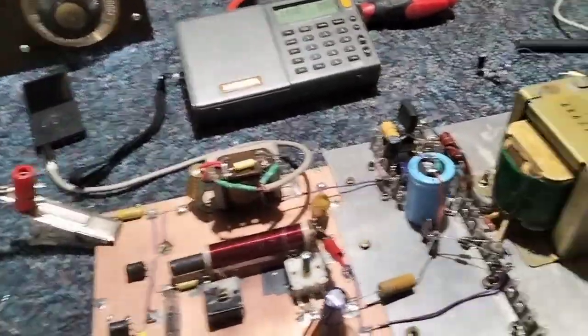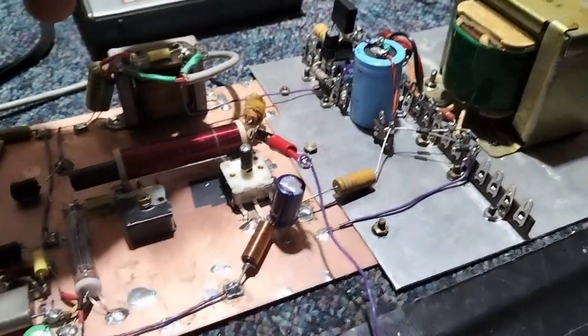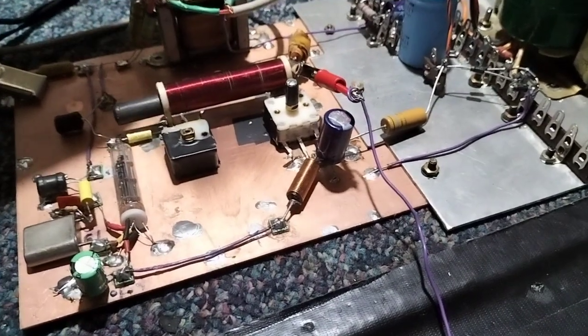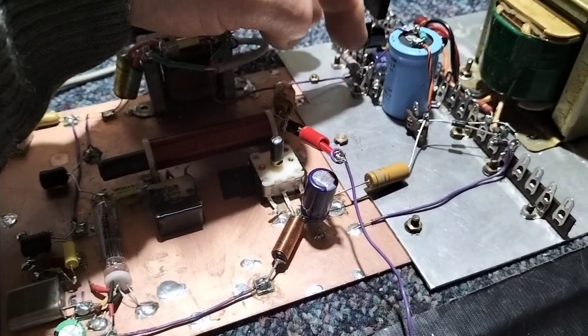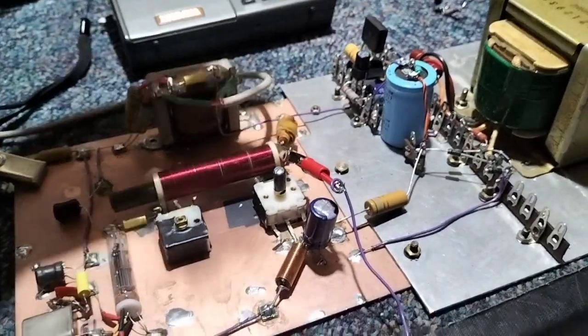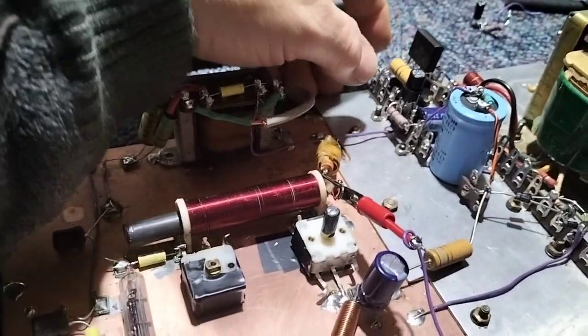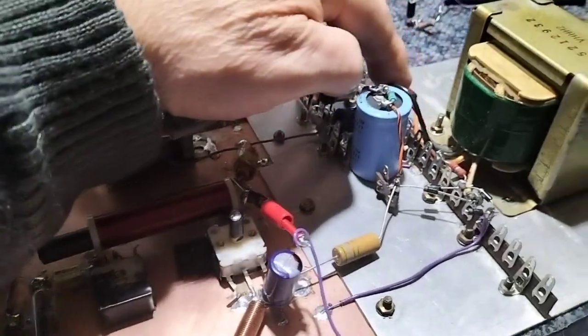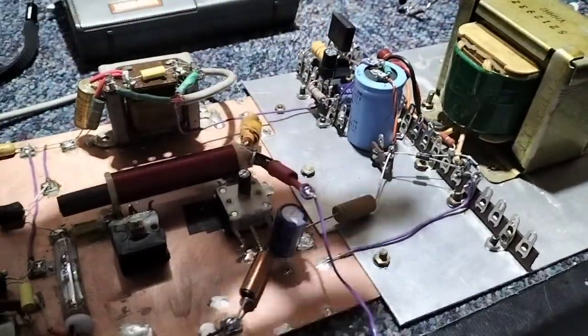These little things are easy to do. The power supply looks a bit more complicated, but all it is is a bridge rectifier for HT and a Schottky bridge for LT. Pretty high smoothing to keep it clean — it's a filamentary valve, so we need to make sure the filaments have no AC ripple. The HT is well smoothed: first smoothing is 100 µF, second is 330 µF. There's a little Wickman fuse just in case something pops. The smoothing resistor is 470 ohms — we're not using a choke. This little 150 is actually between two tappings in series to give a bit more HT. This is a video transformer out of an old video recorder, so don't throw things away — they can always come in useful, even after 20 years.